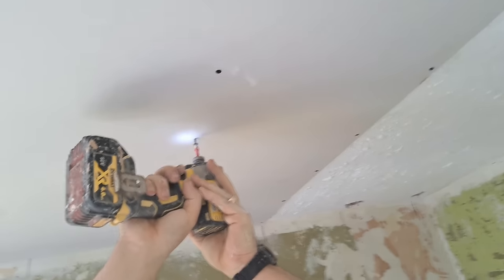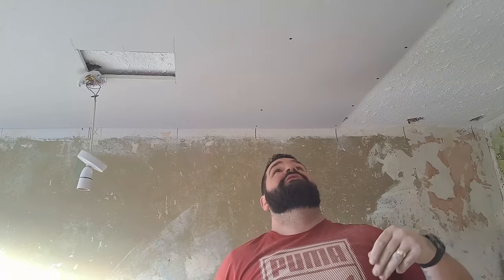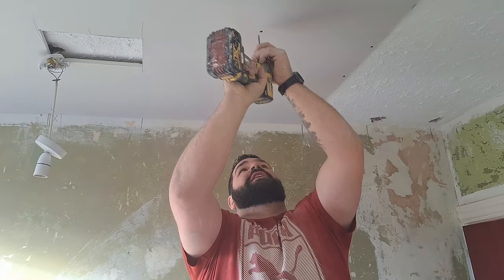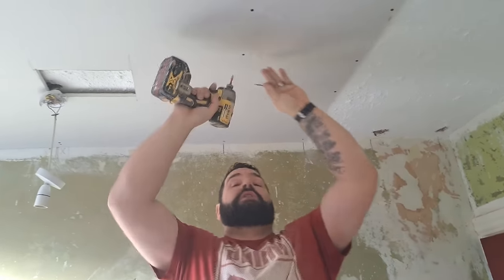Another little tip: if you put a screw in and you've missed the joist, don't just go mad with the screw gun. The joist might have a little bow in it. Your joist is about two inches wide, so don't go wider than two inches in case you go past it. Put a screw an inch one way, if it's not there go an inch the other way, then another inch, then another. Work your way out systematically until you find it. Too many times I've seen jobs where it looks like it's been hit with a shotgun — a million screws everywhere, not one in the joist, all sticking out wrong. Work methodically and you will find it.